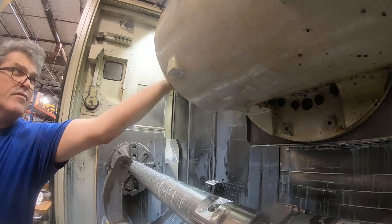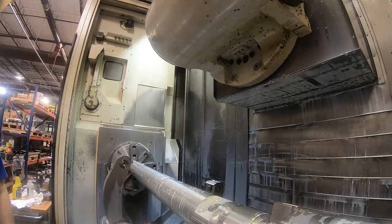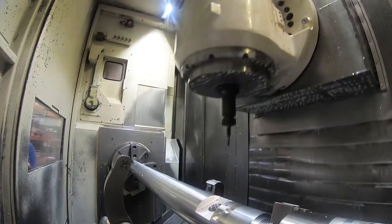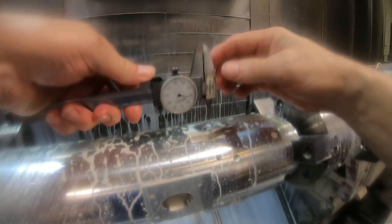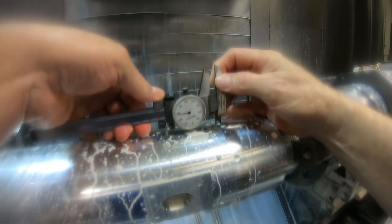I've got to set this 1/4-inch end mill to rough out this other hole. If you look at the graphics, I've kind of given you a look at some of the real part, and you can see the holes there that are going lengthwise. I think the purpose of these is to put plugs in there to seal those holes off from where they come out the face of the part. So these also have a particular shape and a close tolerance on the diameter. That's just the rough out.